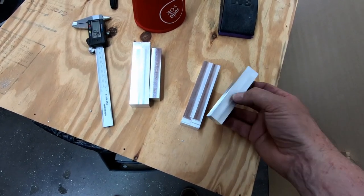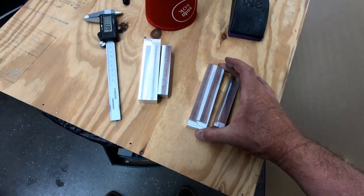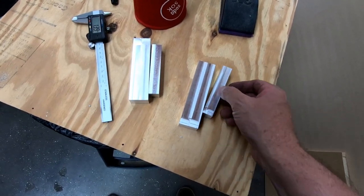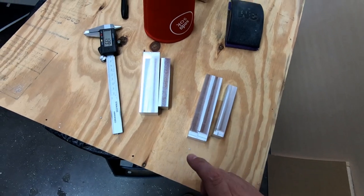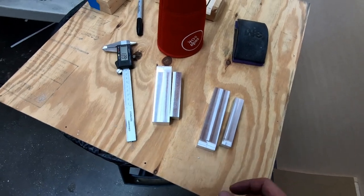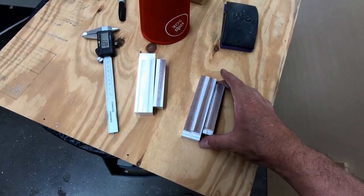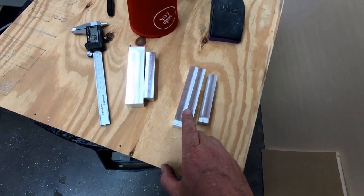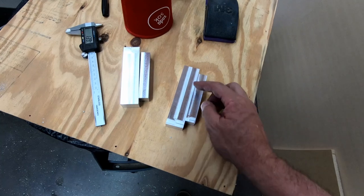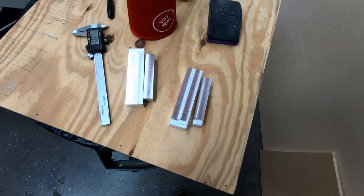for the clamp for the gear. What I did notice though is, I kept these maybe a half a millimeter thicker and wider than what the plans call for, just for cleanup, just to have a little bit of extra space. But I did notice that the gear leg from Grove, which is 5/8 of an inch thick, is actually 1.3 millimeters thicker than what the gear is supposed to be to fit in between the clamps that we're making. So I did add a little bit of width to this upper part, and I also added about a millimeter to this lower part, just so that if I'm going to make this cutout, I have a little bit more material here than what the plans are showing because of that thickness of the gear.